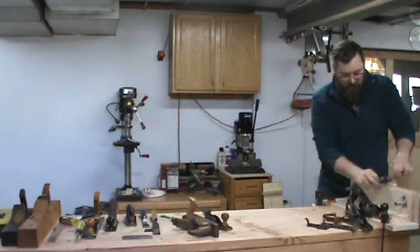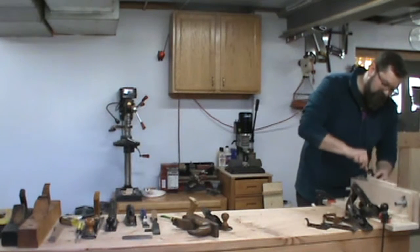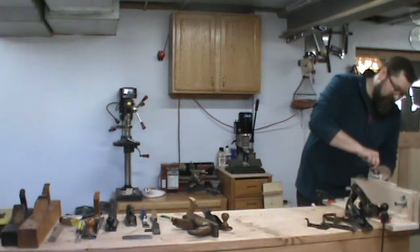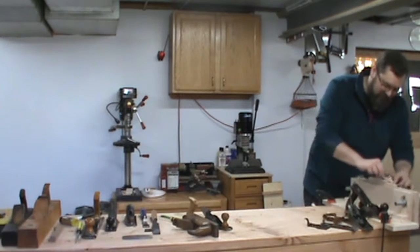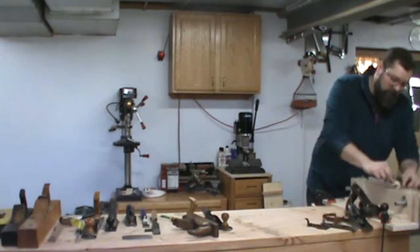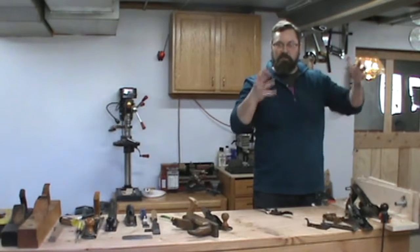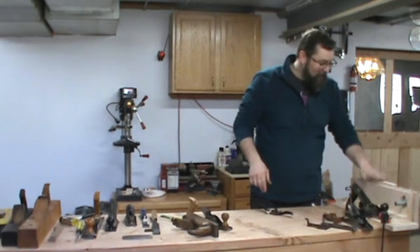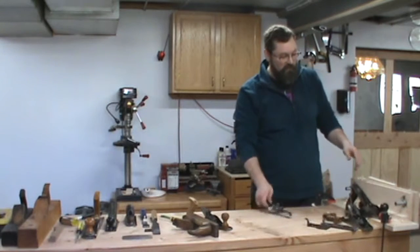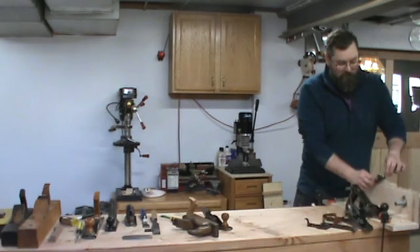This is a pretty foolproof way of putting a curve on something. This really helps illustrate how difficult it is to think in three dimensions and know exactly what you're cutting, because the wood grain is conical as the tree grows. When you cut a three-dimensional rectangle out of that, it's going to feel like it's reversing grain on you throughout. So you have to go by feel and take light cuts, and when you feel that it's tearing out, just make sure you go in the opposite direction.